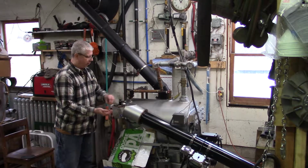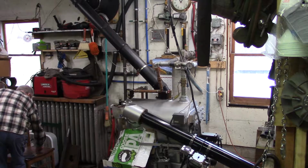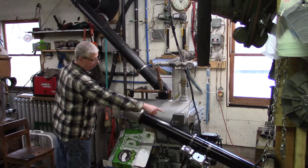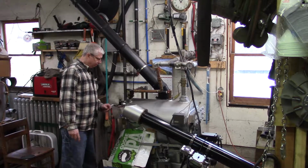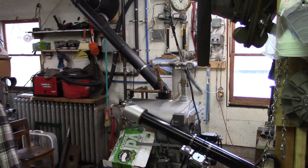Put the 3 brass nuts that hold the cover plate on to the side. So we've left the upper bearing cage and the chain off of the auger, so I have this all silicone together. I'll get the box cutter knife and we'll slice that off as best we can.